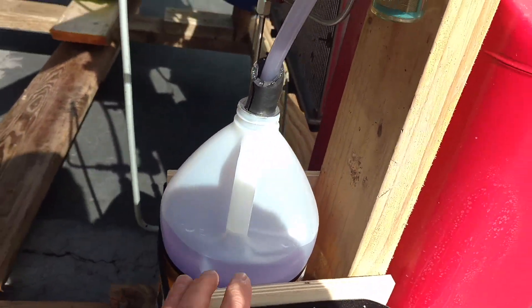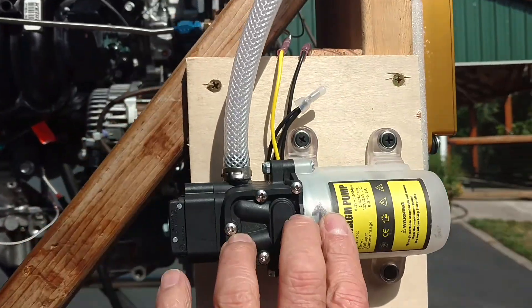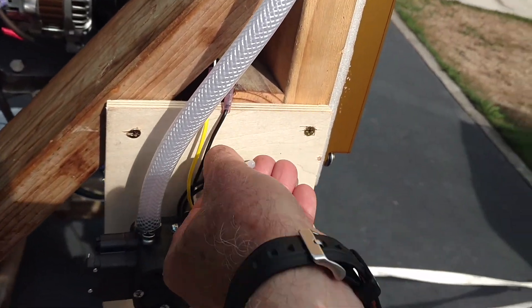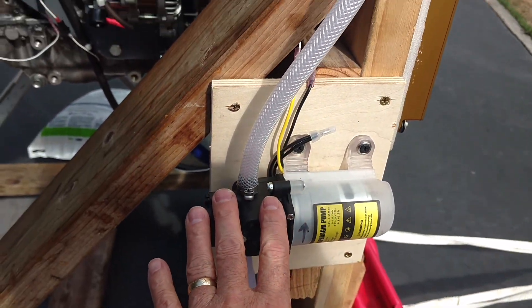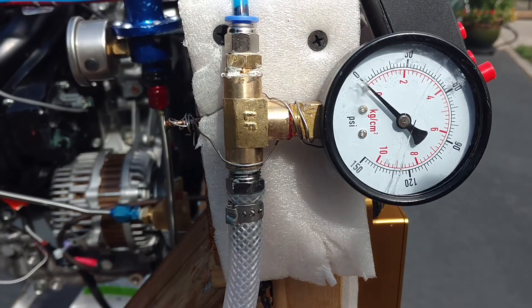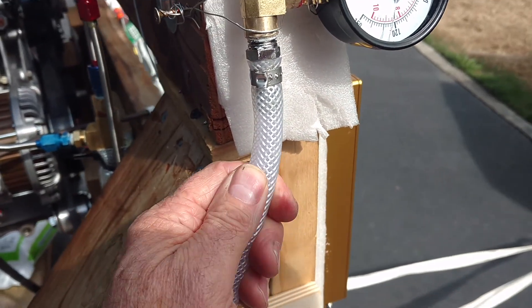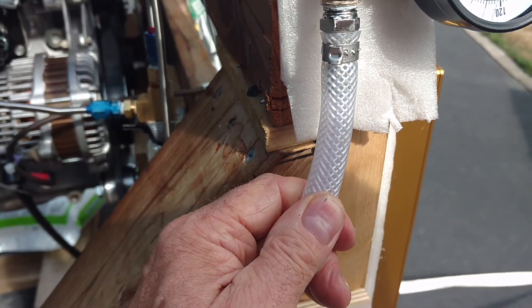Pretty simple reservoir here, down here. This is 50-50 water and methanol. I've got a really inexpensive pump here for just proof-of-concept testing. You'll see that I put together the wires here on the pressure regulator because I want to run it at full boost, which is about 115 to 120 PSI. Obviously reinforced here on the pressure side of the pump — this is actually reinforced silicone.